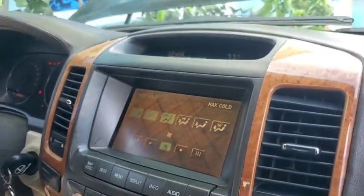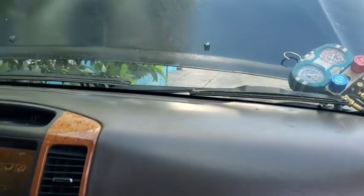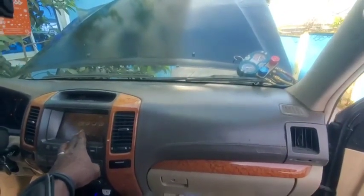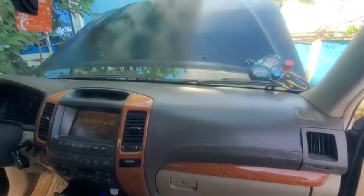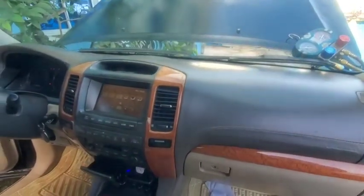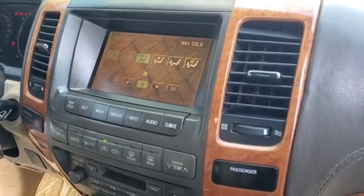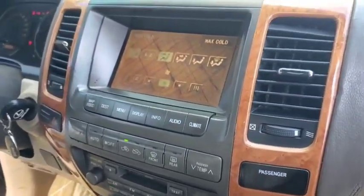So we're going to do this again, and this time I'm going to try to capture both the gauge and the compressor. Now you guys can see it right there — I'm going to put it on and let's watch the gauge. The gauge did not flinch. You just hear the noise right there and it starts flashing again. They have condemned a lot of things, which most guys will do, and that will take a lot of money from customers. In the end, they don't know exactly what the problem is. You can't solve a problem you don't know — you're only going to solve the symptoms.